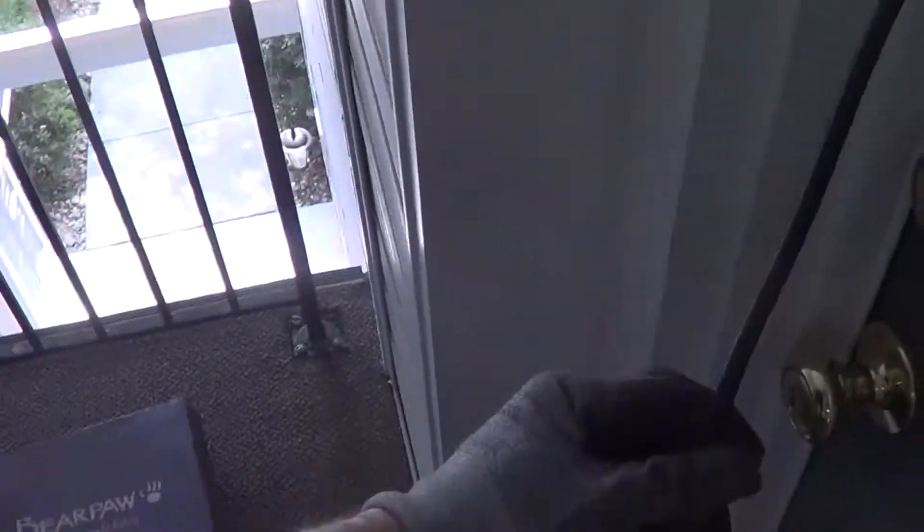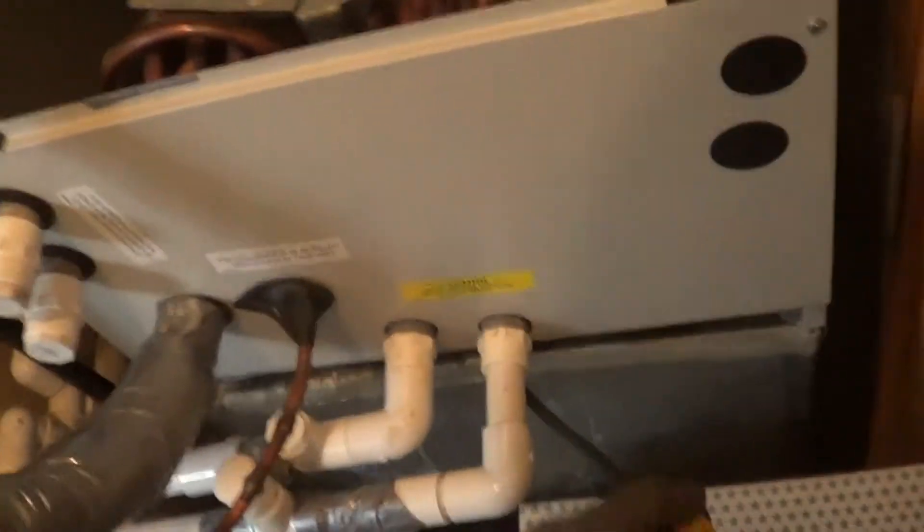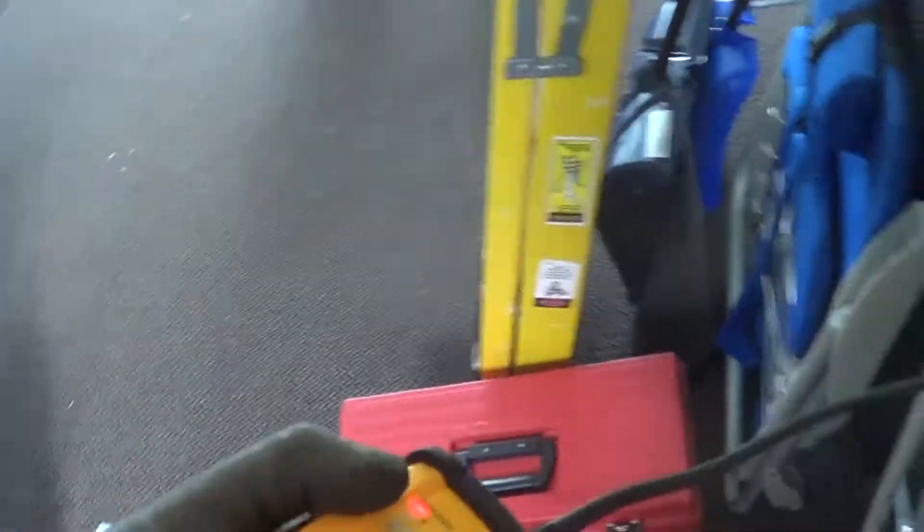Now here's a good false hit — which I know it's not. Notice how the house sets it off. That's the humidity change, and that's normal for this leak detector. When you walk into the house, it sets off. Sometimes houses can actually have concentrations of refrigerant, but on this unit the return air is right where I'm checking. If I go outside, I can get a false hit just by checking the return air — but I'm just picking up the humidity change on the house, so you have to ignore that and realize what's happening.